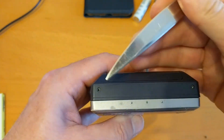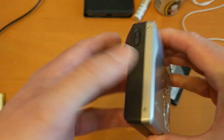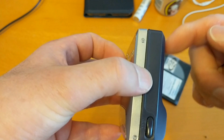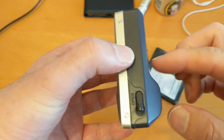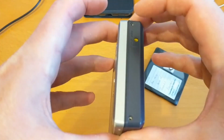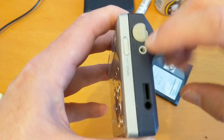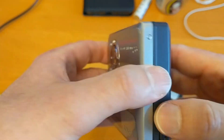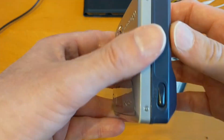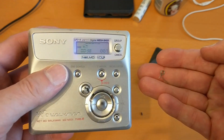I've just got to put in these tiny little screws — these are the four screws that take the back off, and they all appear to be the same size. To remove the back cover from the rest of the unit, tilt it here and angle it that way, because the plastic bits stick through the case. If you're doing it yourself, do that — but be careful, you might end up breaking that part.